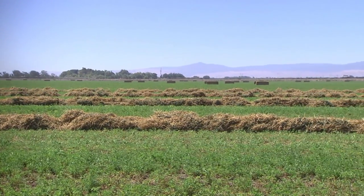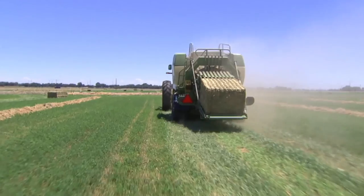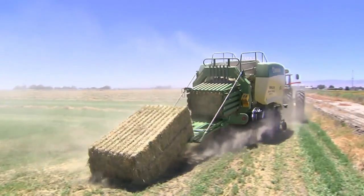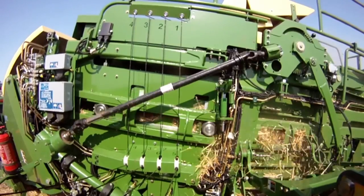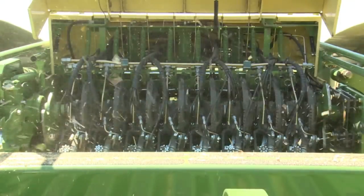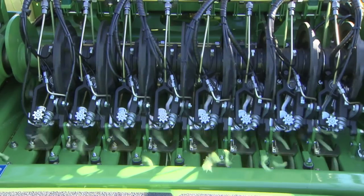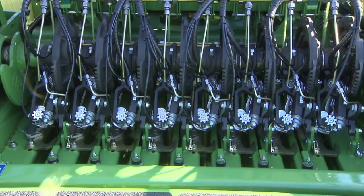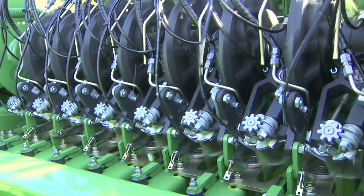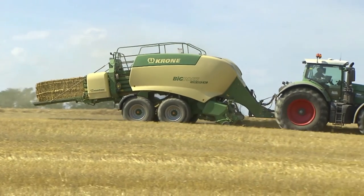Contractors and farmers ask not only for high capacities and operational reliability, but also for innovative technology. The BigPak HDP2 delivers high density, well-shaped bales even at high ground speeds. This puts an enormous strain on the twine and knotters, especially with baling material that has a strong tendency to expand. Therefore, Krone developed a brand new and patented knotter system especially for the BigPak HDP2. This system comprises eight slim double knotters. The individual threads are exposed to less pull and thus can hold denser bales. Another advantage is that the system can use twine that is not as strong, but longer.